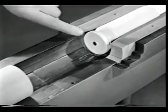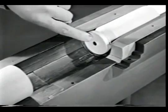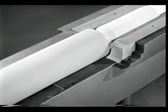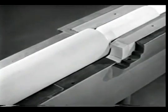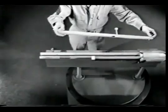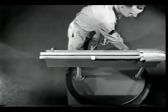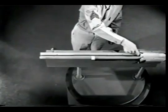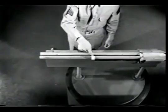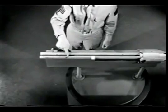To fire the cartridge, we must strike the primer. However, the bolt is in the way. Apparently, we'll have to go through it. This bolt was prepared for that. The top half can be removed. It has a channel running through its entire length. All that is needed is a rod to reach from one end to the other.